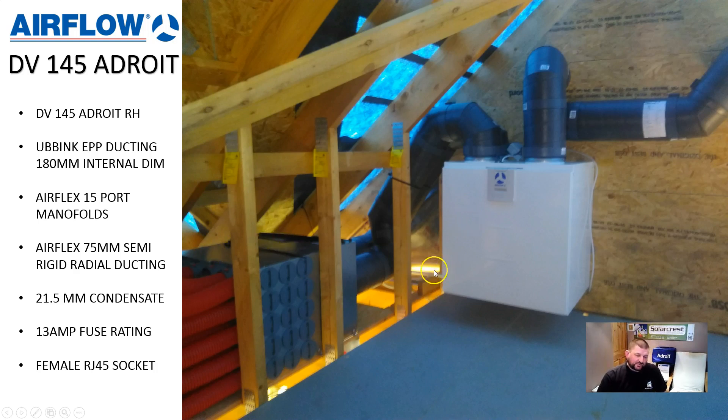As you can see, I just referred to this earlier as the condensate drain. This is connected underneath there — there's a little trap and then there's a slight fall. This pipe runs to the soil pipe somewhere, which isn't yet installed on this job but will be.